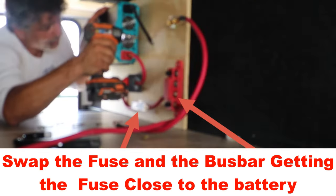I ordered Alex Tech split sleeving — my goal is to sleeve the inverter wires and go under, making sure no wires are touching anything else. I plan on sleeving the wire going into here as well — even on plastic there's a chance of rubbing. A friend also recommended these wire clips — I only need a few — to clip the wires and keep them secure so they don't move as we're driving.